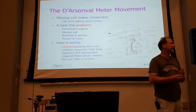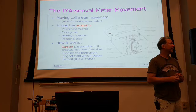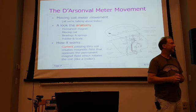I was in broadcasting, and back in the 70s, we still had to do meter readings for the transmitter. They needed the plate voltage, the plate current, and the antenna current every 3 hours. The FCC required that. They wanted a 2/3 scale on all meters. In other words, if your plate current was 2.5 amps, you had to have a 3 amp scale.